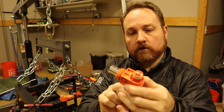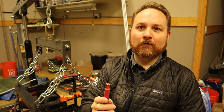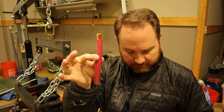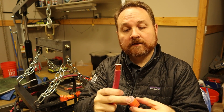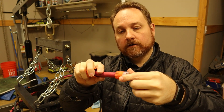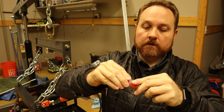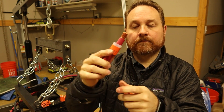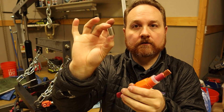In all of those cases, you can order it with the two backing pieces, which you're going to need. I'll show you how this connector goes together by actually putting one together. I've created a little test piece of cable here. The first thing you have to do in building the cable is to put this piece on. Then the second thing is to take the little waterproof piece — the cable goes through there, and this is a pretty tight fit around the cable. You can twist this up. Then you put the little ferrule crimp end on.